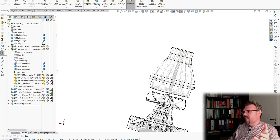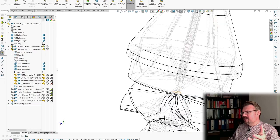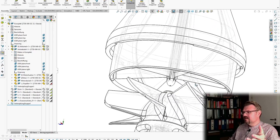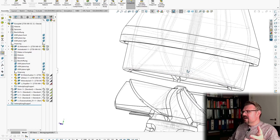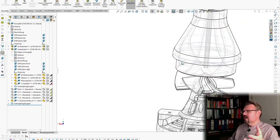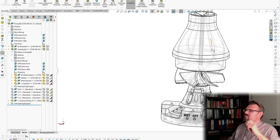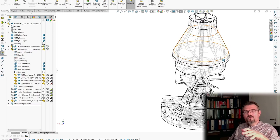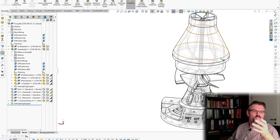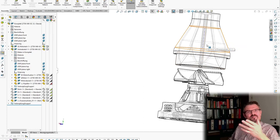And if we have now a look inside, what I have designed here is that we take this. Yeah? Here are the guide vanes. We take this and slowly break it down. I hope you can see this. Slowly break it down and then also narrow the thing so that we have a little bit more velocity, hopefully, and we can balance the ball. Yeah, so that we straighten the fluid.